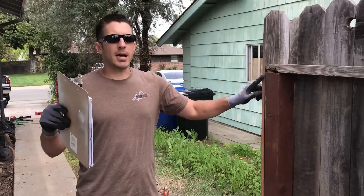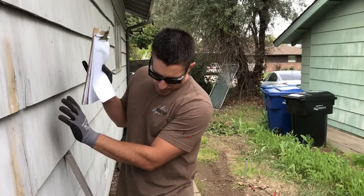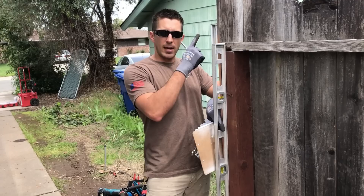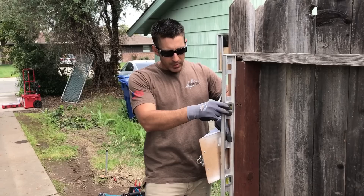We have our measurements now. We have 55 inches from the top of this post to the house, and the house is actually kind of leaning in a little bit, I think it's because of these shingles or cedar shakes. At the bottom we have 55 and 3/8ths — it's a little wider. The post is actually leaning out that way as well, so they're both parallel. It's important to take note of that because you want to work with your shortest width so that we don't pinch our gate.